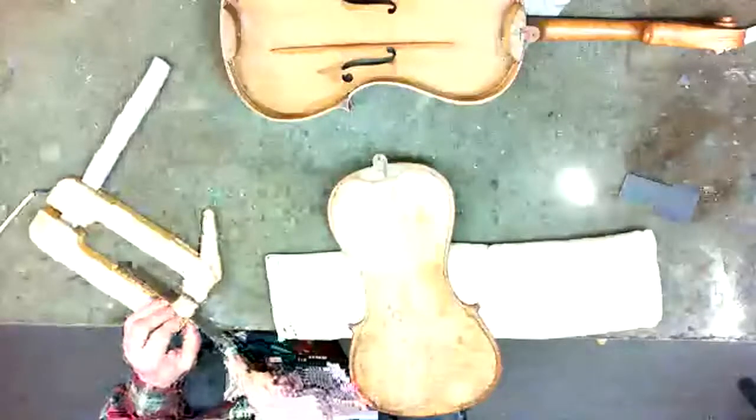instead of carving it down, we're going to cut through most of the way, removing the excess wood. That'd probably be easier to see over on this side. Basically cutting this biscuit in half, lengthwise, most of the way. We want to leave it connected so it serves as a clamping jig.